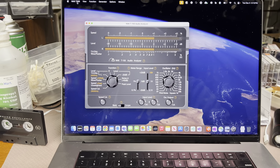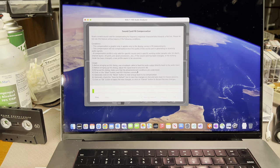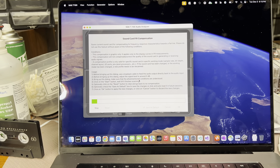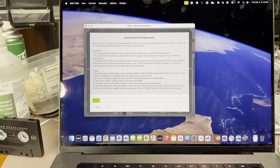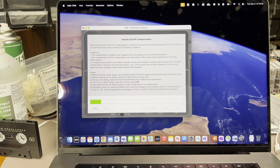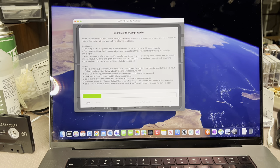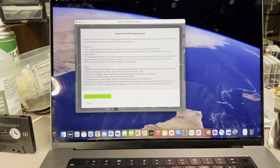Output to input, and now we will use calibration for the card. It will play a frequency sweep and adjust the card response, so our equipment's response will be subtracted and we will have ideal measurements — we'll be measuring only results from the tape recorder.